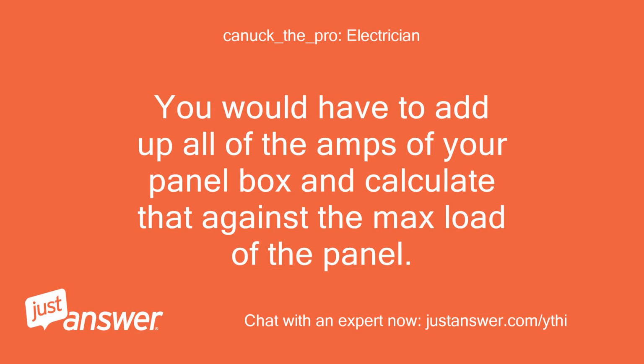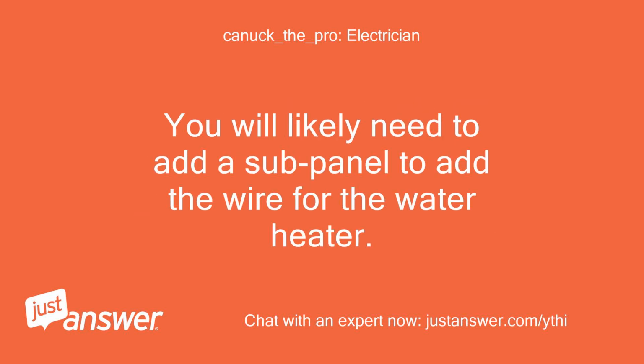You would have to add up all of the amps of your panel box and calculate that against the max load of the panel. You will likely need to add a sub-panel to add the wire for the water heater.